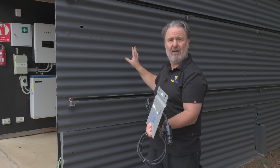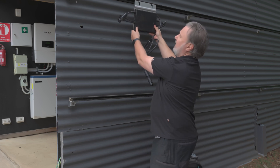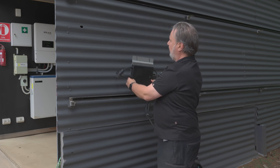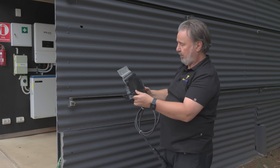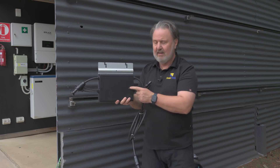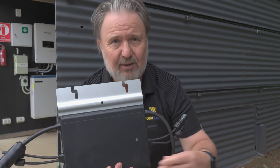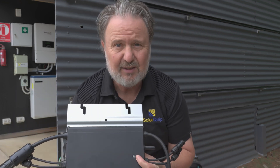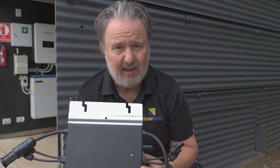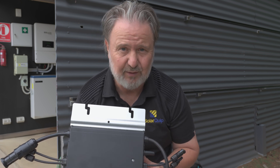We're going to put two panels up here on the demonstration wall. We're going to mount the microinverter behind it here — probably on the rail as it's supposed to be — so that we can see the small LED on the front. This little LED is a status light, so it tells you things like: is the grid available? Is it synchronised with the grid? Is it operational? It's got a little green light when it's operational, and little red flashing lights when it's searching for the grid.